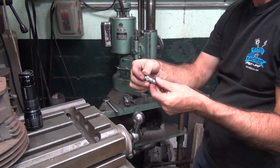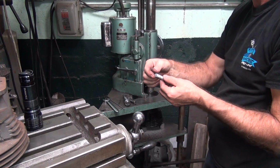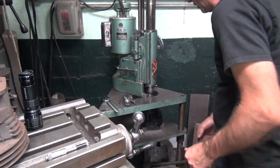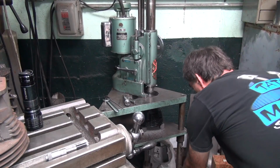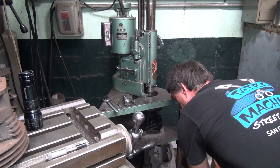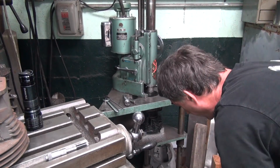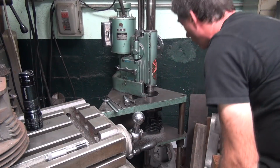Where's our mic at? We are on 17.5. Kind of went in. Had drag, but not quite like I thought it would be. Okay, we go 17 3/4 thou. You definitely have to push it in there, so we'll go with that number. So it's a 1/4 thou more than I thought it was going to be after the first measurement. Still a 1/4 thou under what we needed on the low number. All right.